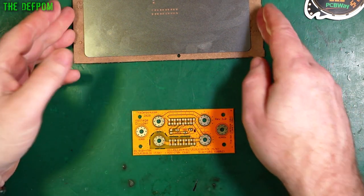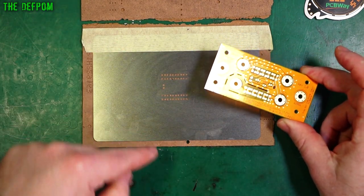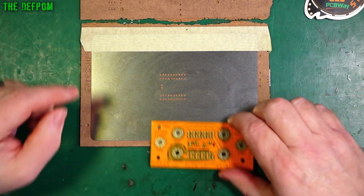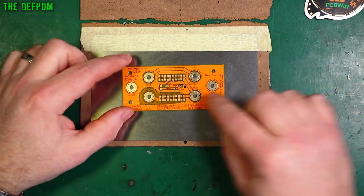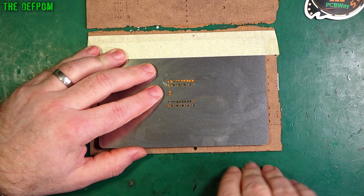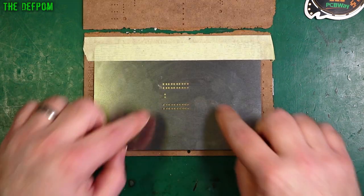When I got these boards made, I had PCBWay also make me a stencil to make the process a lot easier. If you're doing lots of boards, you make a little jig — a corner piece — stick it in the corner and it lines up with the stencil. I'm just going to slide this underneath and line it up manually under the stencil, then paste from there. I highly recommend PCBWay — check out the links below. I use them for my boards not only because they sponsor me, but even before that I used to get my boards made by them and I've been very happy with their quality.